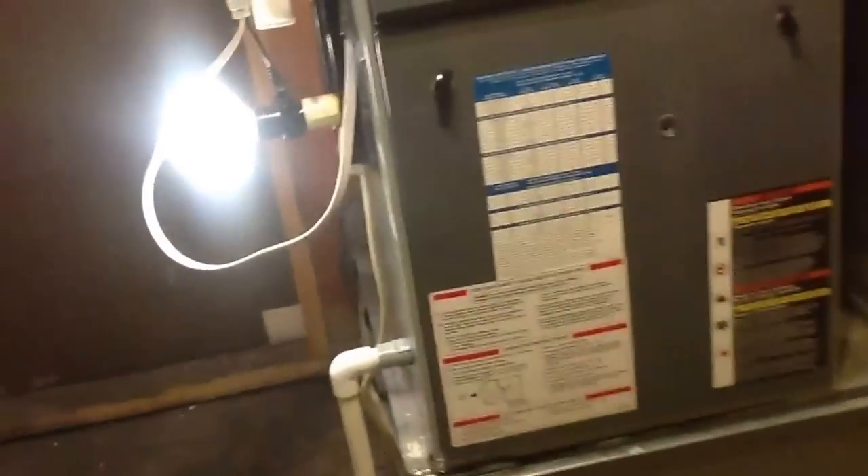Number one, the resistance between the neutral line and the ground line is infinity when I measure it with the generator off — it's a floating neutral. The other reason is that when I started fiddling around with that neutral to effect a repair, I got a shock. Now, if I got a shock, so can a lineman if you have back feed in your arrangement. That is why I harped on that: do not back feed. You think just because the neutral line is grounded? With your generator, it might not be. You really never know. You've got to test these things.